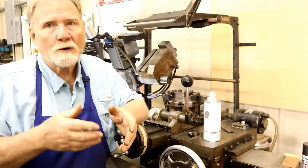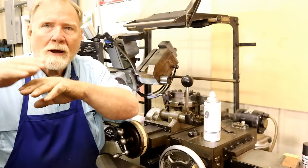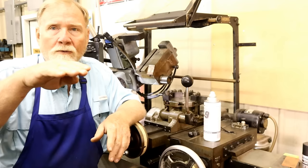Well, that required 3 different layers of wood flask or outer container, whatever you want to call it. And sand was poured in and packed in layers. And there's a joint in between each layer that was there on purpose so we could take it apart. You put parting dust on it so that it doesn't stick to each other. So right there, you've got an open pathway through the layers of sand to the outside.